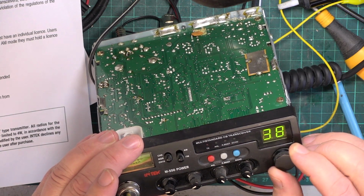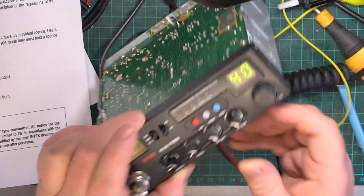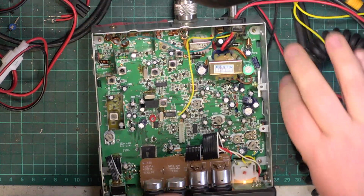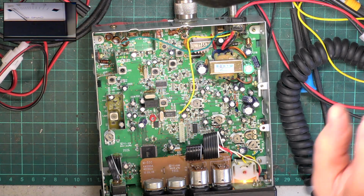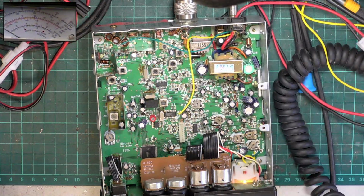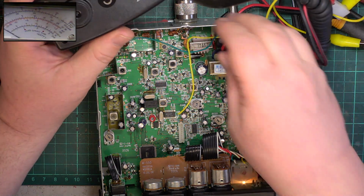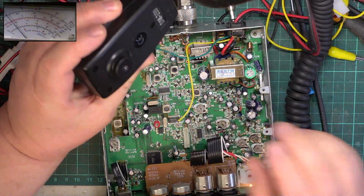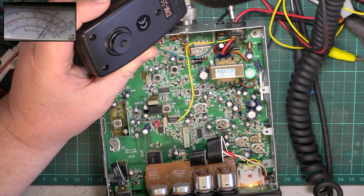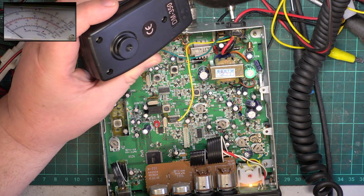There we go. I'll go to the top of the shop for that. So now AM, FM. So we'll do that modulation. Go back to picture in picture. And go back to there. So out of interest, what's the... Oh, here we go. So 27405, and the radio now does 2 watts. Now it's on AM, and we need to go to AM on the modulation meter and tune it in.